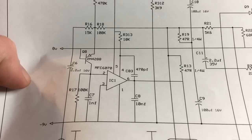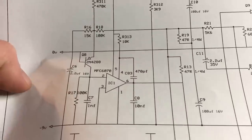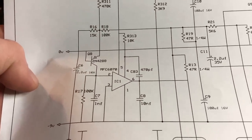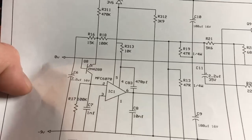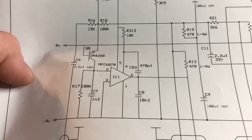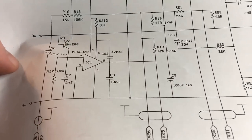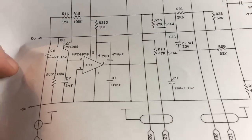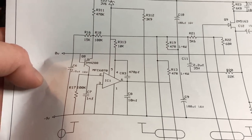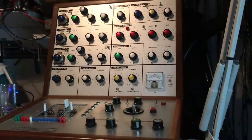There is a mod board that you can buy which replaces it with another 741 but also has a couple of germanium transistors. After all the price is done, the actual original IC is actually just a couple of quid more, so we'll have to see what the owner wants to do. But apart from that, everything else is working okay, just no reverb.